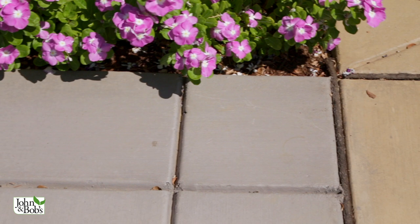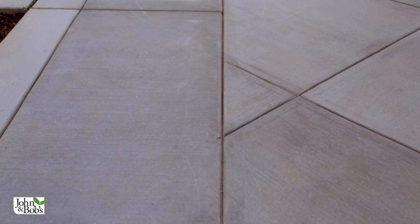We used very simple paving that isn't expensive — actually one of the least expensive options — which is plain concrete in one area and colored concrete in another. Most of it is plain gray concrete with score joints. If you look closely at these score joints, you can see that one of the main purposes, in addition to being decorative, is that you direct all the cracks to those spots. Look into these score joints and you'll see there's a crack all along them. One thing we do at the end of a project is that you put the concrete in fairly early on and then walk all over it and scuff it up.